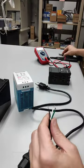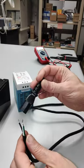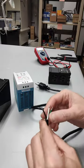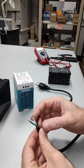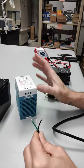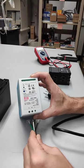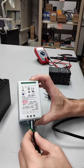And again, you'll want to check specifically on your country. Here's this old part — you can keep this if you need it for something. I'm going to set it aside, we no longer need it. In the U.S., and I think in Canada, but double check, we typically have green corresponding to ground, white is our neutral line, and black is our hot, or our live line.